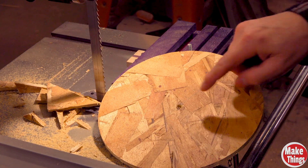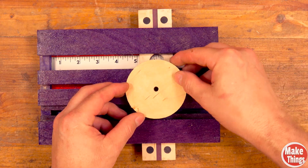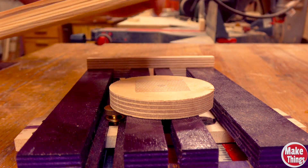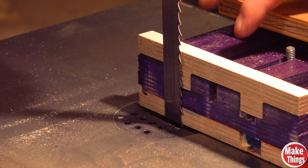Now, I know what you're thinking — yes, this has a hole in the center. But to create a circle without a center hole, I created a turntable. The turntable fits on the bolt and I add carpet tape to the top of it, then I just attach a square and cut. Of course, because bandsaws pull downward, it's important to have a safety bar next to the blade.